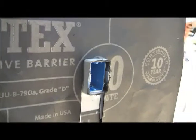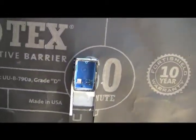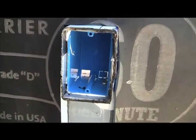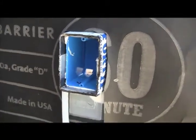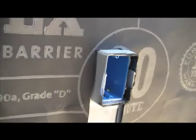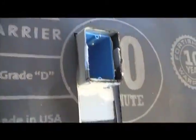Here's your electrical box nicely flashed. This method will work with double boxes just as easily. Wider and larger boxes can be flashed with lightning flash corners, but may need to be bridged with Fortiflash if they're wider than five inches. As you can see, this was simple and very effective, and you benefit from having only one product on the job that can flash many different types of boxes versus having to inventory different products. We hope you like this!